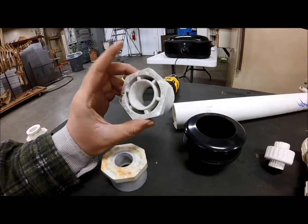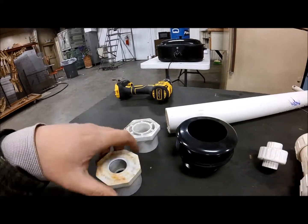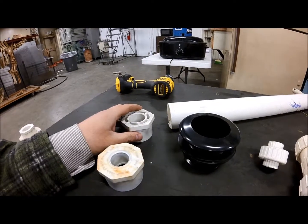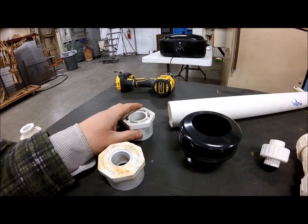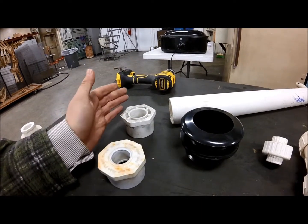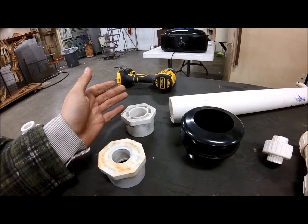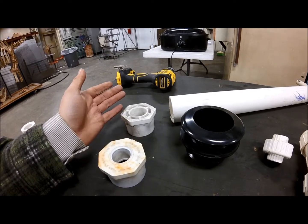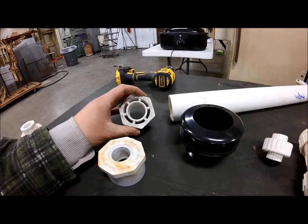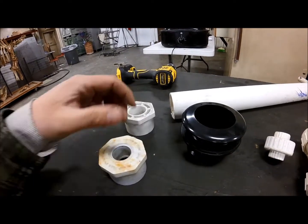And so this one is a 2-inch to 1-inch reducer. You'll generally want to go with something smaller unless you can find yourself some 2-inch Schedule 20 pipe. Now most of our pipe today is Schedule 40. The only way you're going to find a 2-inch Schedule 20 pipe is if you're looking at people that have vacuum systems that they put in. That's the only reason that they're using a Schedule 20 today, is for vacuum systems in like wood shops and things.